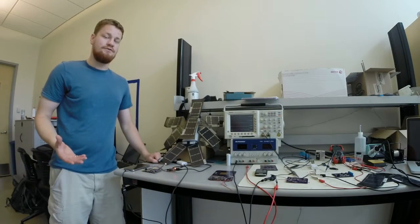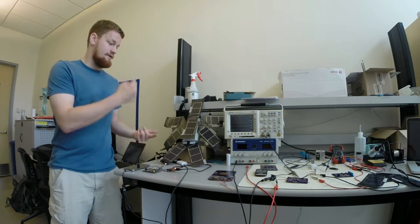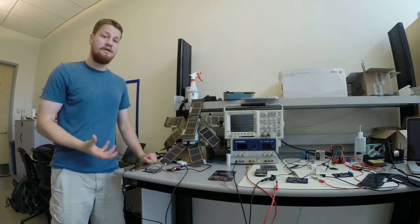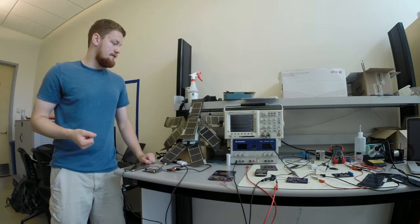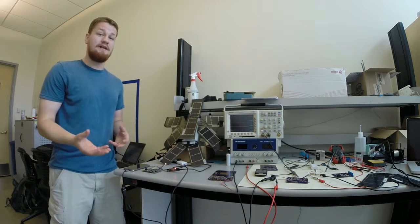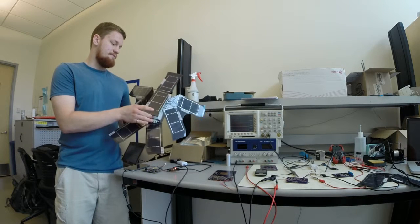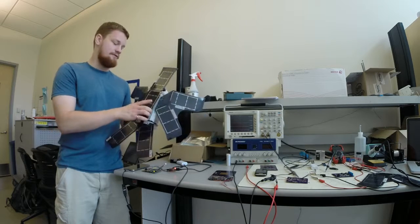So this project was split into two portions, one being the electronics portion and the other being the mechanical portion, involving an enclosure for the device and a frame in order to attach the enclosure to a tree. Now, what they are currently using out in the field is a small Radio Shack enclosure that they place the phone and batteries and hook those together. And so what we needed for this project was a larger enclosure to fit all the added components for the electronics. So this is a polycase enclosure made from polycarbonate, and it's been modified for adding a heat sink for thermal dissipation from within the phone battery itself.